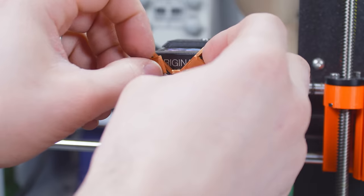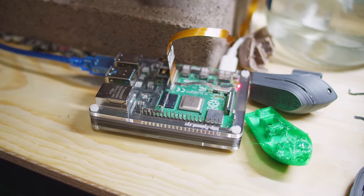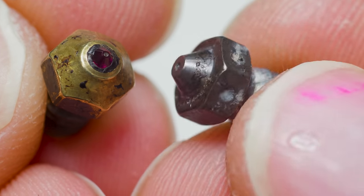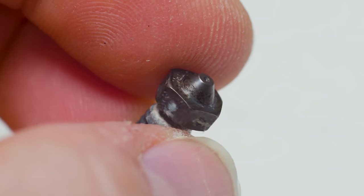In the 3D Metaprints video, we added some overhead lighting, an extruder spinner, and a Raspberry Pi also running OctoPrint. Depending on what I'm making, the Squire is always fitted with either a 0.4mm Olsson Ruby — yes, I bought a second expensive Ruby nozzle, hashtag buy it for life — or my most recent acquisition, an 0.8mm E3D Nozzle X. The latter is a rock-hard tool steel nozzle coated with nickel and non-stick unobtainium. The non-stick coating makes sure that things go on the print, not on the printer.